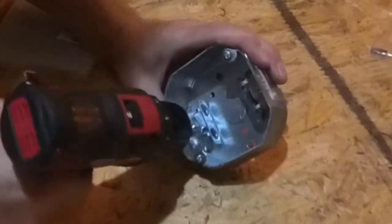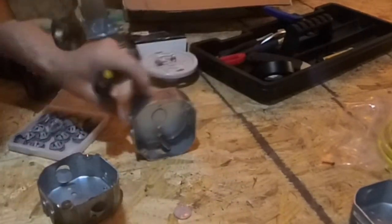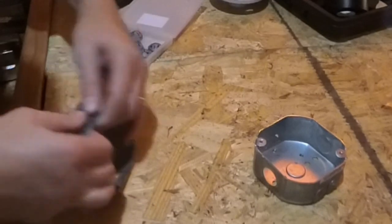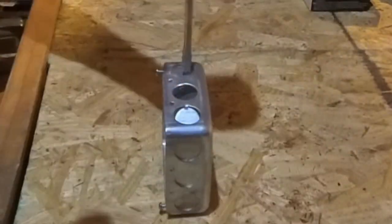This is the preparation of the next 3 electrical boxes. I'm removing the clamps that are for a different type of cable and the lid screws that are too short to use with the light fixtures. Then I break loose the slugs out of the knockouts with a hammer and screwdriver and twist them out with needle nose pliers. Gray plastic cable grips are inserted into the knockout holes. These allow the wire to be pushed in but not pulled out. The junction box was prepared in a similar fashion. It has 4 gray cable grips, 1 in, 3 out.